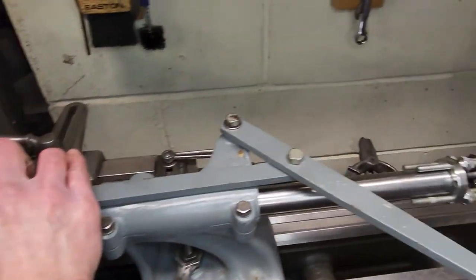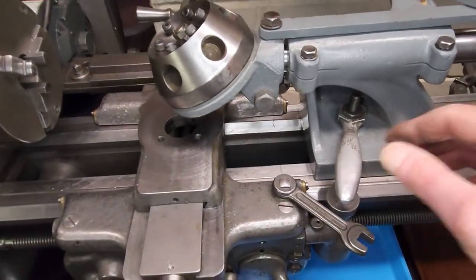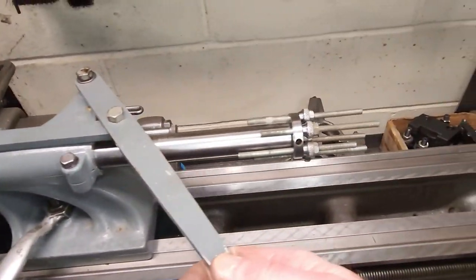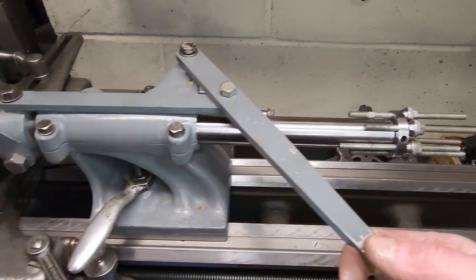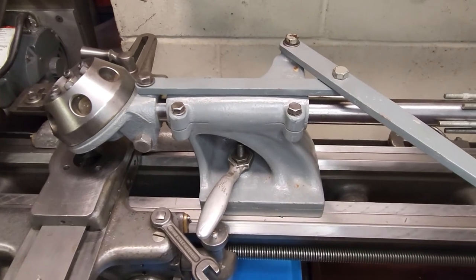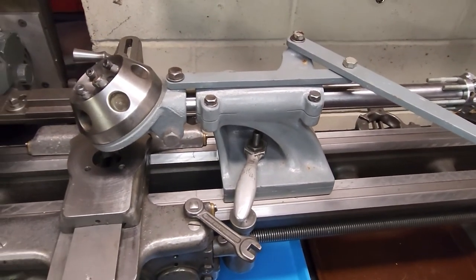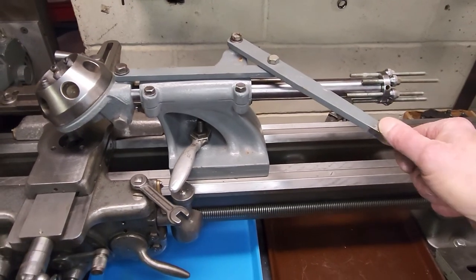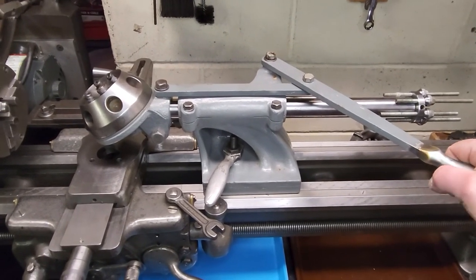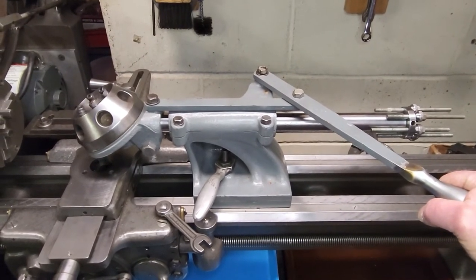It's also self-indexing, so if you move the hand wheel all the way back, you can rotate to the next tool. The stops also rotate as you're rotating the head — click in. You can have up to six tools mounted, individually set for the depth that you want each one to go to. It's an Atlas 10-inch lathe accessory mounted on my 9-inch South Bend, and it works pretty darn well. Just an idea for those out there — these hand lever turret tailstocks are much easier to find for the Atlas 10-inch lathe than for the South Bend 9-inch lathe. So if you feel the need for a turret tailstock, this might be a good way to obtain one.